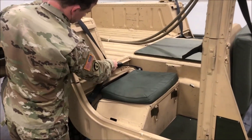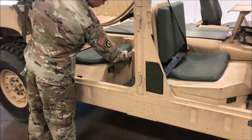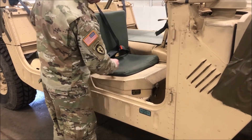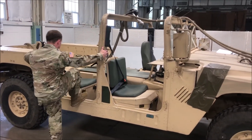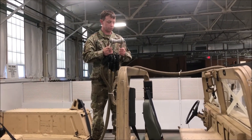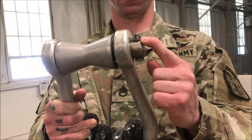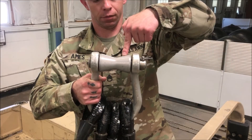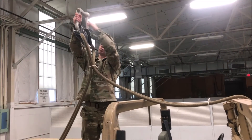Next, verify that the passenger side rear and front seats have their seatbelts secure and that all latches are secured with 2-inch pressure sensitive tape. Enter the vehicle from the passenger side to inspect the 10,000-pound apex. Verify that the apex is set up for the appropriate aircraft, ensure that a castellated nut is present, that the crowned portion is facing out, and that there is a cotter pin present. Incorporate an apex spacer if the aircraft requires it. After you have completed inspecting the apex, you will now verify that the sling legs are properly routed and in the correct sequence.